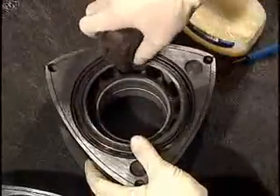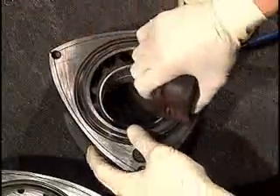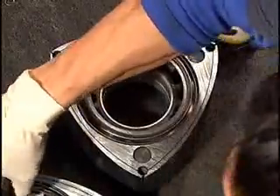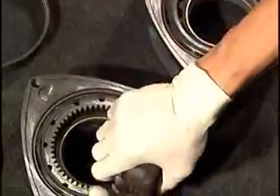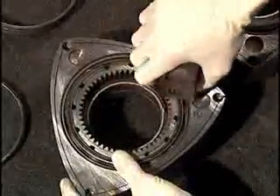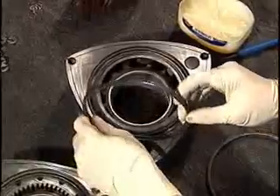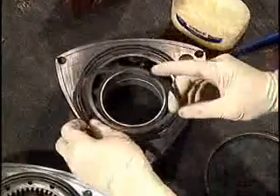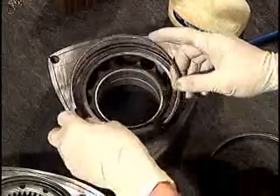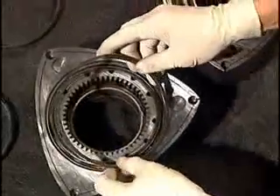Use a piece of wood that has been sanded smooth to help with the installation of the oil rings into the rotors. Keep pushing down carefully on the ring, walking around the ring until you feel it seat. The outer ring is more difficult to install — be careful that you don't slip because it may cut you. Install both rings on both forward faces of the rotors.